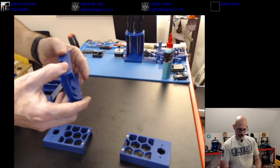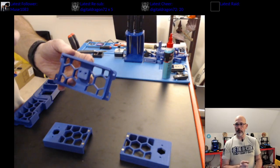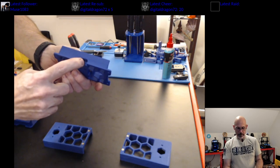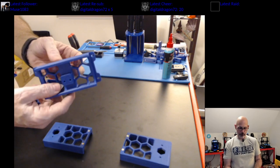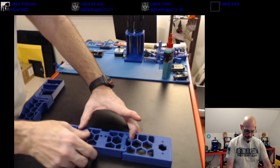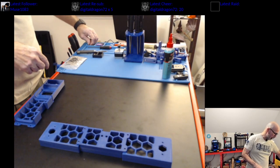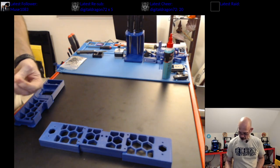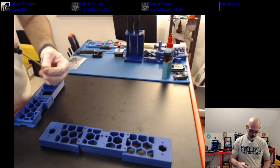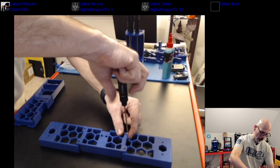That just felt like I had a layer line. On this piece, this is where your screen's going to mount. And on this printer, I've got an interesting mount solution going on. There is a hole at the top. This is the top piece, so you'll just have to be cognizant of that when you go to mount it, that the gap will be at the top. We'll go ahead and use those M3x8 screws again. Probably get away with M3x6s on here.